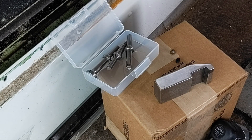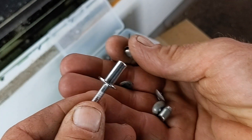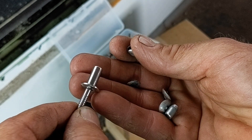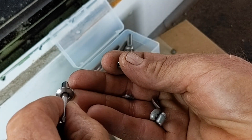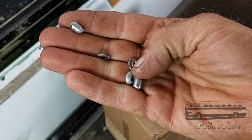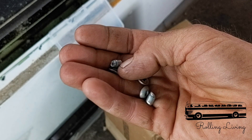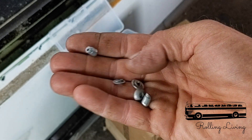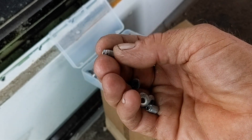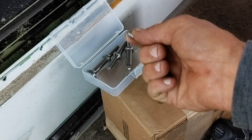In another video we showed you how to take out blind rivets or tubular rivets. They're called blind rivets because you can install the rivet from one side and you don't need access to the back. We showed you how you can cut that, push the pin out, and cut the tube off by cutting the head off with a chisel. You shear the head off and push the shaft or tube out the back.